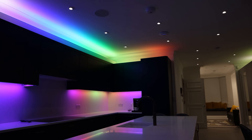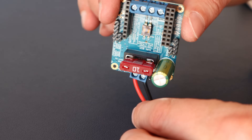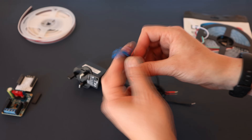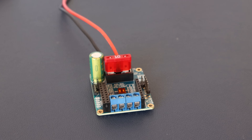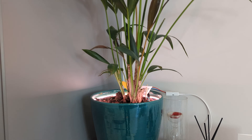Now don't get me wrong — the Dig Uno controller is really practical, and I still use it to control larger runs of individually addressable LED strips around my house. What I like most about it is the built-in power management and the fusing, which makes it possible to run longer LED strips with power injection while preventing your house from burning down. Unfortunately though, it's a bit of a faff, because you need to buy a dedicated power supply, wire in all the cabling, and the circuitry is exposed, which means you risk blowing it up if it gets wet or short-circuits against metal. In my opinion, this makes it overkill for smaller installations like the lights behind my monitor, behind my drawers, house plant lights — basically anything under a couple of meters of strip, depending on LED count and effects.